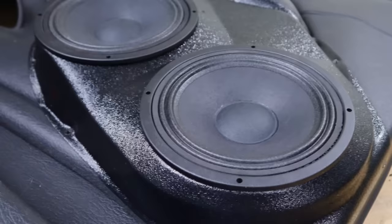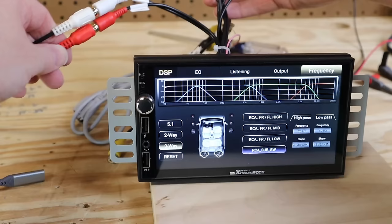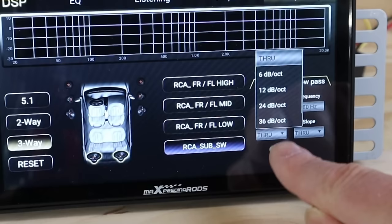If you really want to have some fun, you could order four 6-inch drivers and slap them into some custom speaker pods from customspeakerpods.com — check the video description for a discount code. The rear channels appear to be the mid-range channels, where you'd run something like a 3-inch or 3.5-inch driver — some people call this a middler. With a digital signal processor you can route pretty much any signal you want to any channel you want.